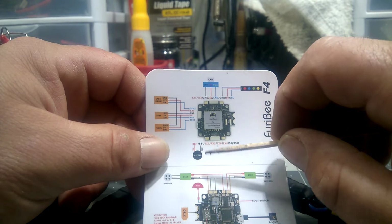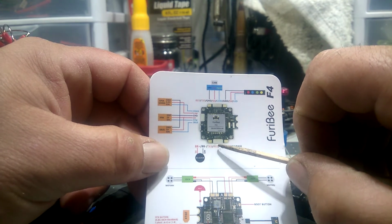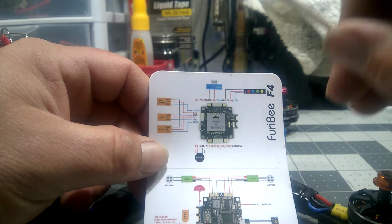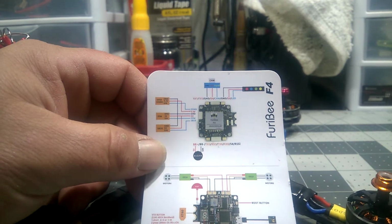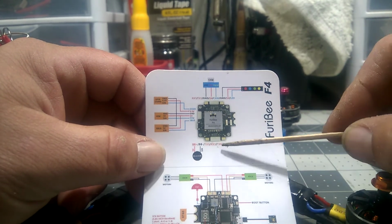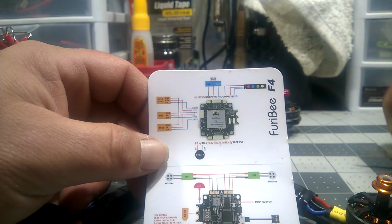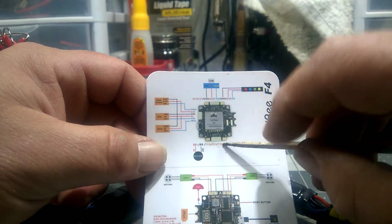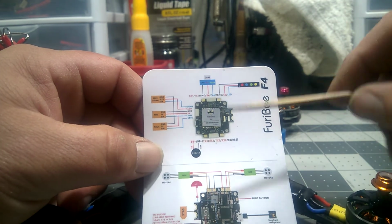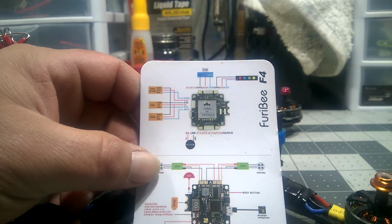Okay, if you want to do telemetry, you will do one of these other ones here, but you do have enough ports. You're going to have to use an RX3 or RX6, as far as I know, if you're going to run iBus. Then you'll just go in on your Configuration tab in Betaflight and do like normal, select your Spektrum, then go down and select iBus, and your receiver will work as long as you're bound to your transmitter. So I just wanted to let you guys know that, because I searched around and I finally just figured it out on my own, because there's really no information on this. Project Blue Falcon, JC, RIP, JC, but he has a couple videos that gave me the idea. It's pretty much telling you to do the same thing.